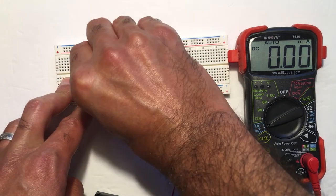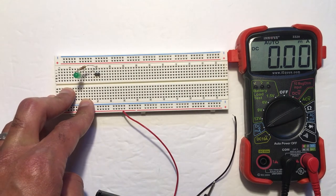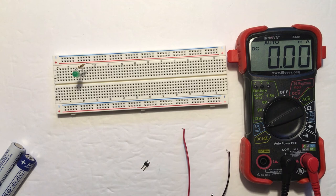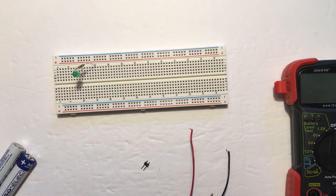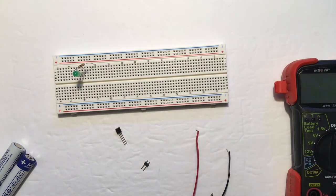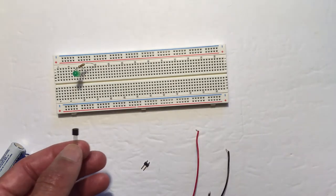Next I'm going to talk about mini project 518. This is another circuit project, and it needs a lot of attention because it presents safety hazards if you plug in the transistor incorrectly. I'm going to introduce these new components: there's a transistor, there's a 1 kilohm resistor. I'm basically going to build the circuit in figure 524.